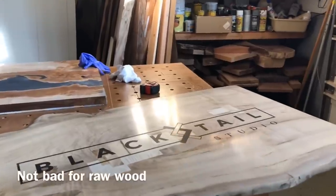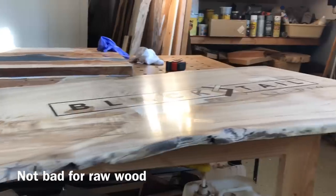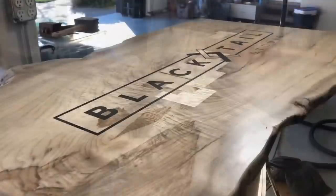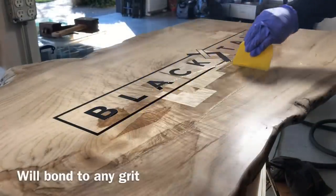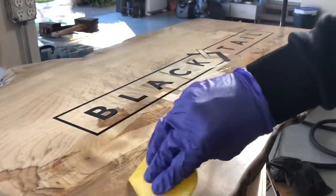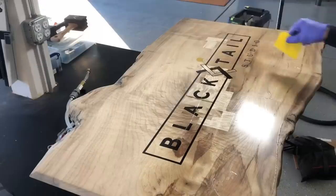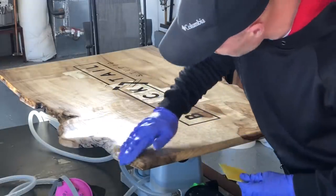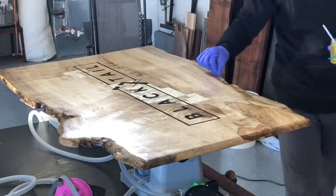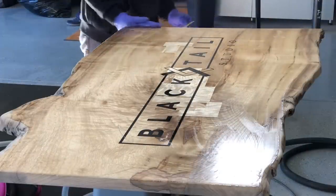It's probably not my first choice for a table, but you just really don't see any pieces of wood sanded this high — essentially burnished or polished to this level. Now, I know what some of you woodworkers are thinking: you can't sand that high and finish it with anything, because most finishes don't go above 180, 220, or even 320 grit. I am using Odie's oil. If you're not familiar with it, Odie says it will bond to any wood sanded to any grit, even oily wood. This is myrtle wood, by the way. Sanded all the way up to 12,000, it got a pretty neat sheen when all was said and done, and really gave some depth to the curl and quilting in this myrtle piece. Odie's oil can be applied to any grit.